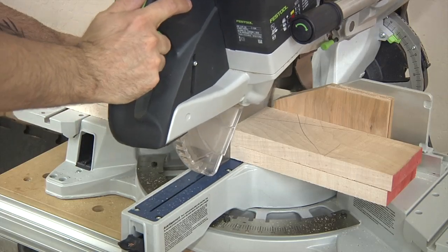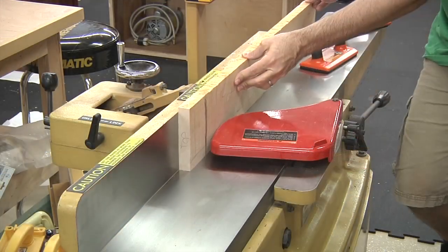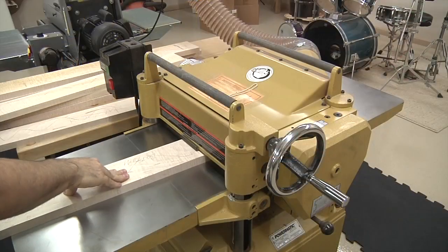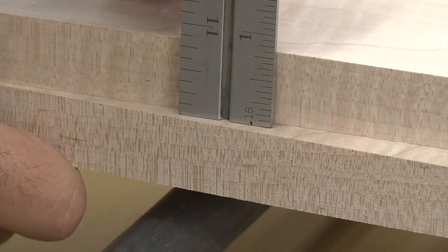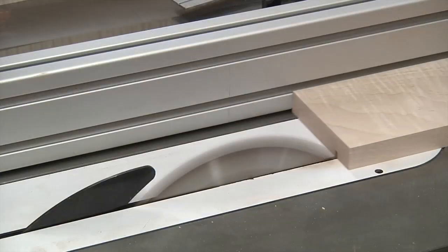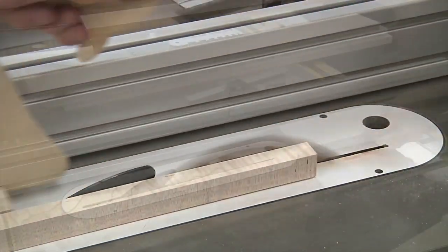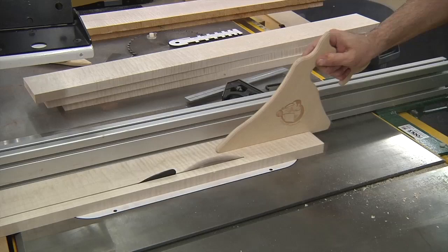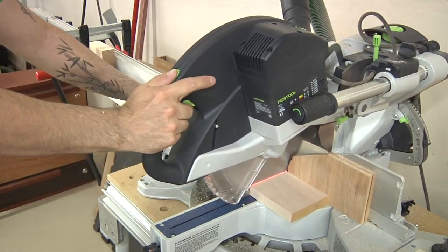The chop saw is an excellent tool for rough cutting to length. Now everything is milled to final dimension according to the plans. With regard to thickness, the plans call for three quarters of an inch, but if you can keep your stock thicker, go for it. Heavily figured maple is prone to tear out, but the segmented head in the planer really does a nice job. Remember to cut these pieces a sixteenth of an inch oversize: three and a sixteenth for the sides and bottom, and four and a sixteenth for the top.